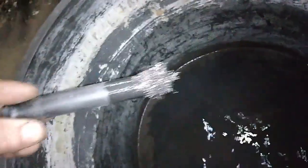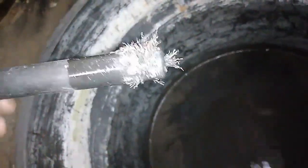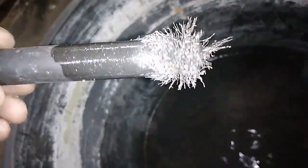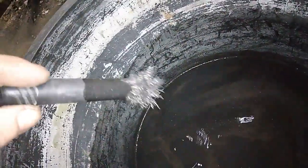So what I'm going to do next with this: I got a magnet, so I'm going to remove everything magnetic. You can see a lot of magnetic material, especially from the RAM IC legs. I need to remove everything magnetic, and after that I'm going to start panning for gold.